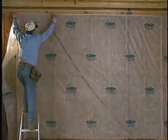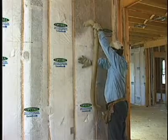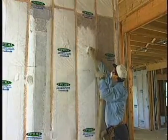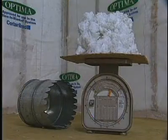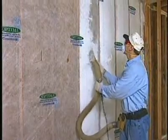Another way to insulate walls is loose fill insulation. One of the more common ways is to apply a fabric to the wall and then insert a nozzle and blow dry fiberglass into the wall cavity, filling it up perfectly. We need to make sure they meet or exceed the manufacturer's weight requirements per square foot, ensuring the homeowner gets the R-value they're charged for. If they density sample early on in the job, they find they typically over-install the required amount, so density sampling early on the job site will set the standard for the rest of the job.